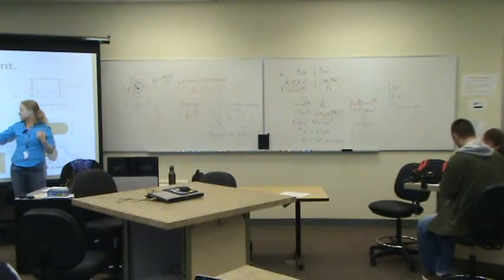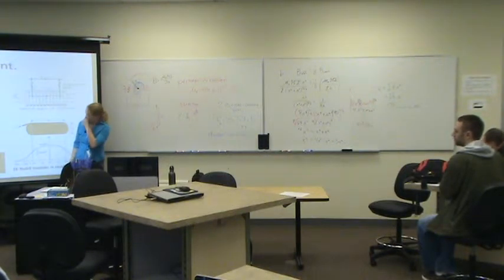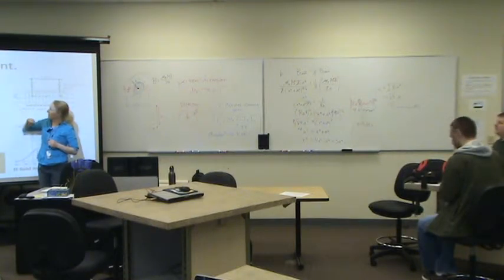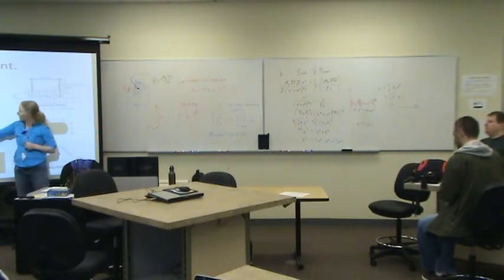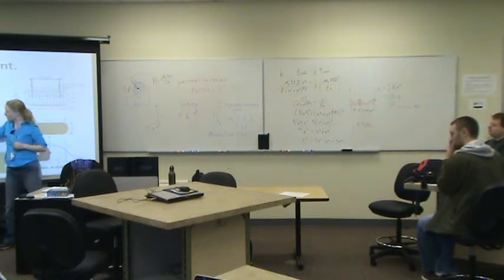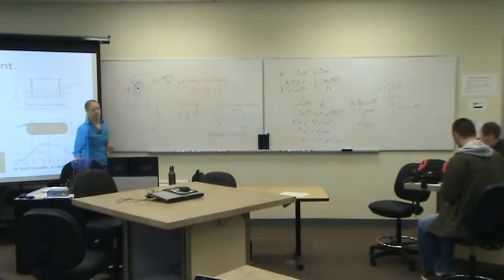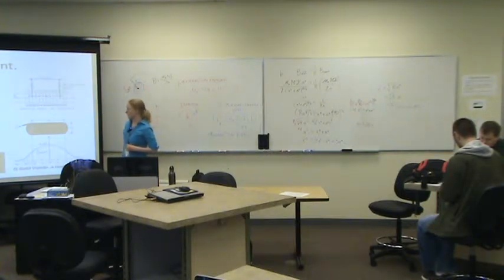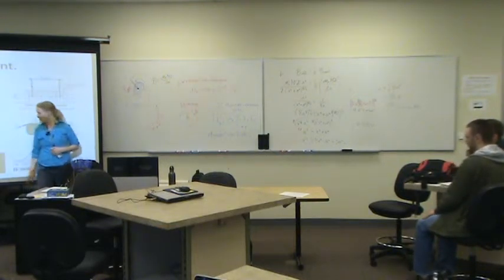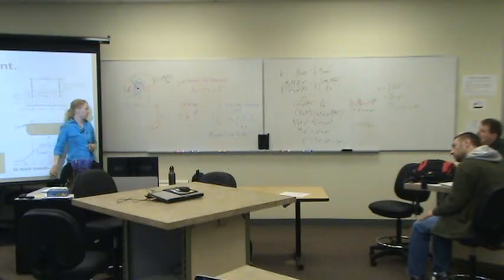And then you could make a substitution here for big N. We just said that was little n times L. So what we had up here was BL equals mu naught times I enclosed. If you plug in little n L times I for I enclosed, we would see the L's cancel on both sides, and we get this result down here. The magnetic field due to a solenoid is mu naught I times little n. That would be useful if you knew the turns per unit length. And if you know the actual total number of turns and the length, then you could use this version of the same equation.